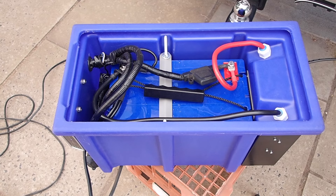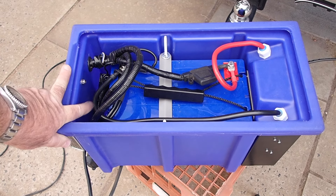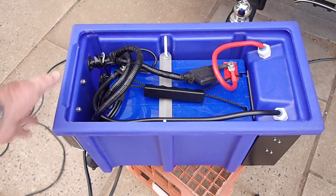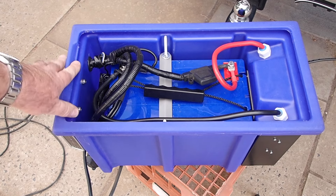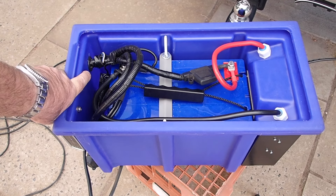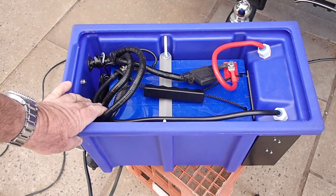I'll give you a look inside. I used stainless steel nuts and bolts with nylock nuts, so there'd be no vibrating loose from the units. I used grommets for everywhere the cables pass through the box. The cables have all been triple insulated with tape, convoluted tubing, and heat shrink.